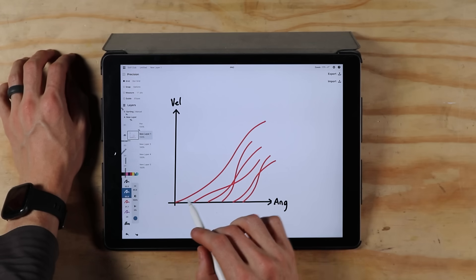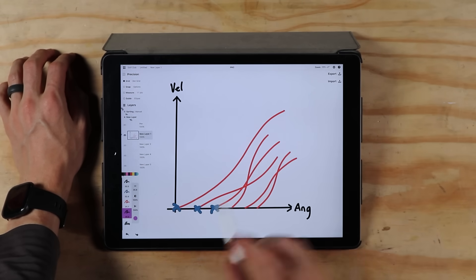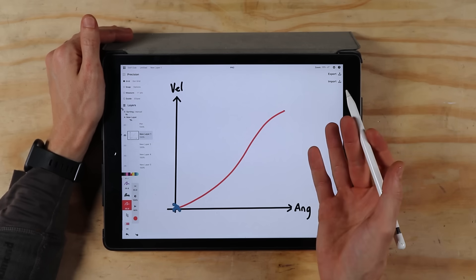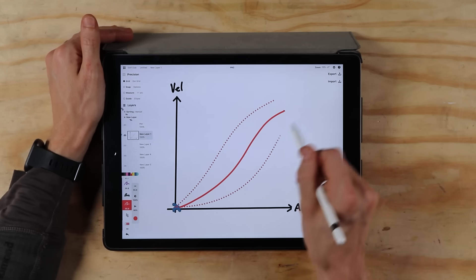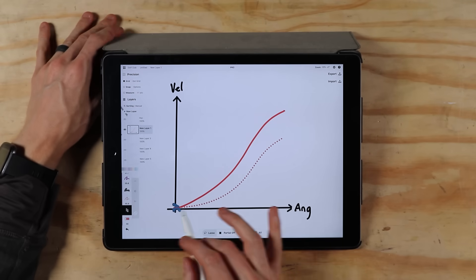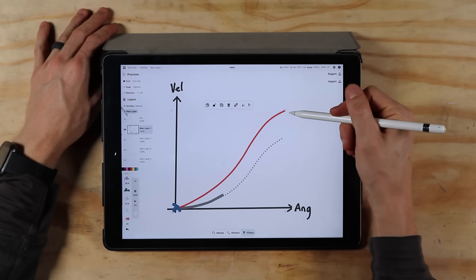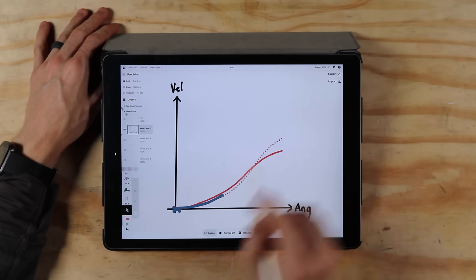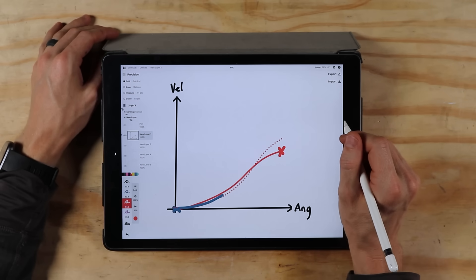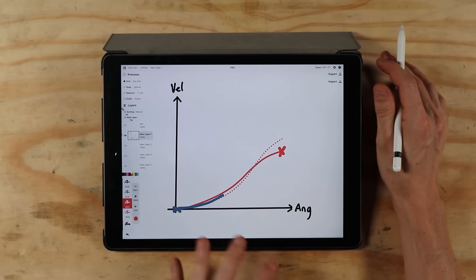You can imagine collecting lots of these swings — there's noise. So what I do is take all these curves and compute the average swing trajectory for each starting position. Then when the club senses me swinging, I look up the closest curve. The tricky thing is that depending on if I'm swinging the club harder or softer, I might get different profiles, and I might get something totally different, in which case this method breaks down. So what I do is take the ideal velocity curve and scale it so that it matches the current data — it doesn't perfectly predict the result, but the shapes seem to be relatively consistent. This seems to work reasonably for my testing. It's tuned to me, obviously — if I was trying to make this a product, I wouldn't use this method, but it was a quick way to get it done.